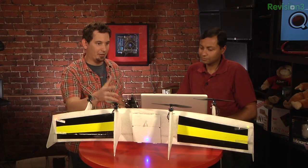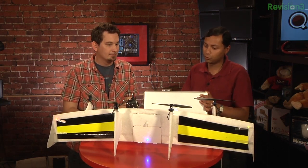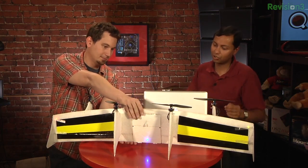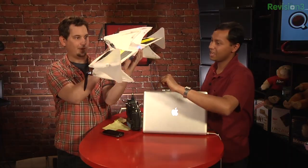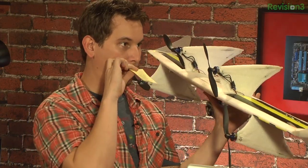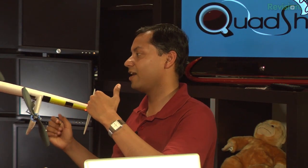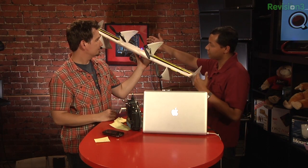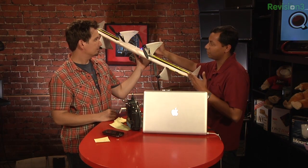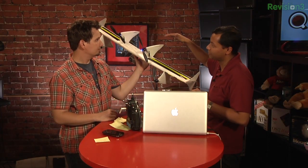When it comes to the shape of the aircraft, that's one of the most important parts. There are several parts to the shape of an aircraft. This is basically a flying wing, and the wing itself is made up of 2D sections called airfoils. You know the whole wing shape — it has this teardrop shape. Every kid has taken a piece of paper and blown across the top. We have 2 or 3 sections within this wing joined together by a loft. The loft is decided by what kind of sweep we want, which is partly decided by drag and partly by stability — we want the center of gravity to fall in a specific location to maintain stability in flight.